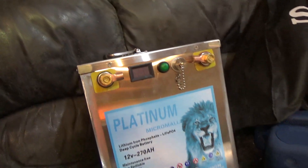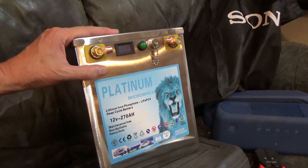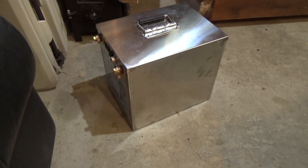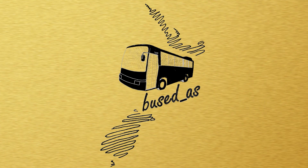It's got a little charging port which seems a little weird. And I know already that this contains 12 prismatic cells — that's what I want. And I bought two of them. So together that is 24 3.2 volt nominal 90 ampere prismatic cells. LiFePO4, or lithium iron phosphate. They're pretty cool cells.